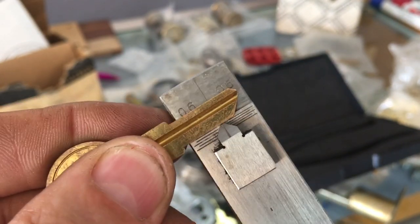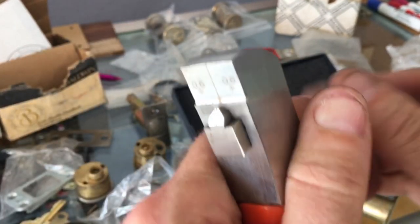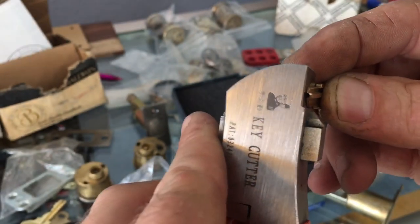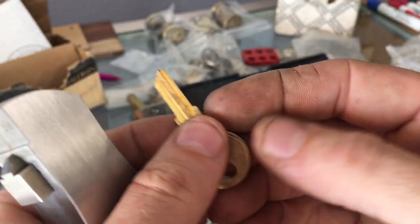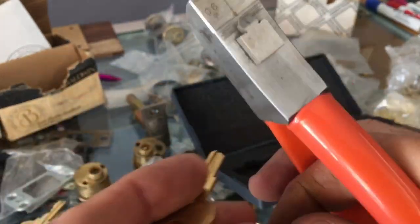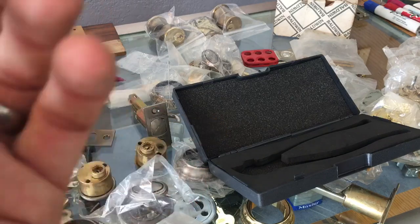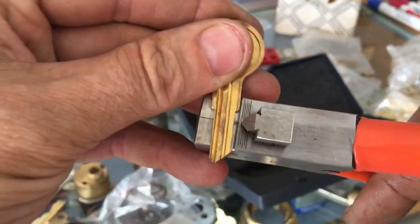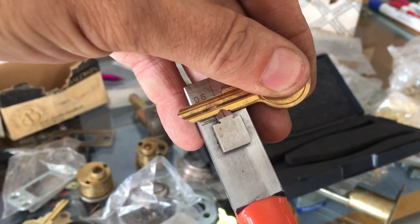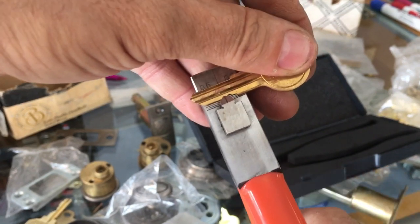With filing cabinet keys I can pretty much get the spacing and depths down — a zero is no cut, a one is just a little bit, two is a little bit more. I doubt I'll use the graduations a whole lot. If you're using a key with the blade on this side, you need to start it so your full blade is resting on that surface so it doesn't distort the key. First key I used it on, I cut the Y11 like this, and because it stands off when you squeeze it, it kind of bends it.